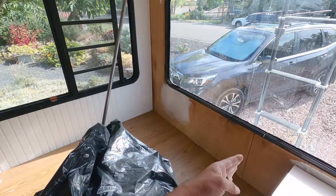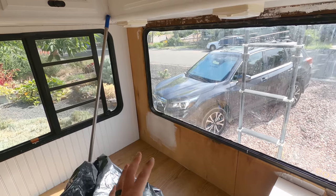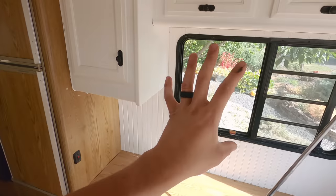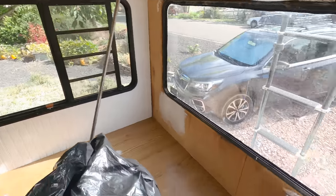I take the measurements — the sheets are 48 inches wide so I don't measure that, but I measure the width and the height, make that into a square, then cut out the window. I measure the window, place it on the backside of the bead board — you always want to cut front side down so the cuts are cleaner — make the cuts, then place it. To install it I use liquid nails on the back to tack it, plus finishing nails into the wood paneling. The window frame also helps keep it on since it's compressed with screws across the whole RV wall.